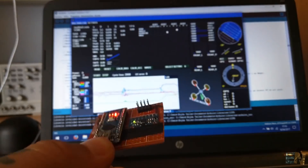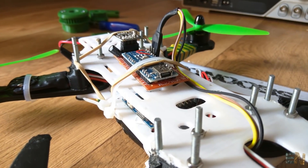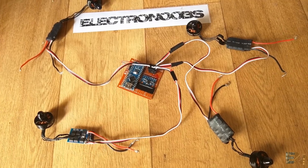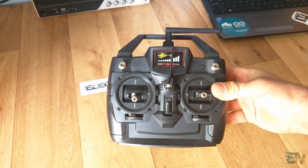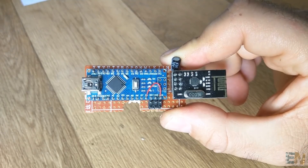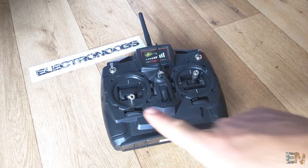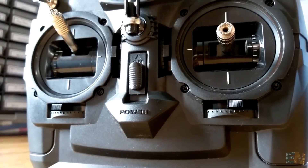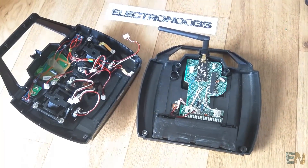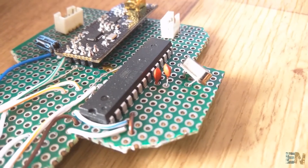In the previous tutorial we saw how to build a flight controller for a fully Arduino-based drone. The construction of this drone has 3 parts. In this part we will see how to build the radio transmitter and receiver. For that I've used a second-hand old radio controller, an Arduino, and the NRF24 radio modules. This controller can send up to 32 channels, each of 8-bit values, at a distance of up to 1 kilometer.